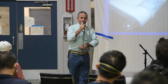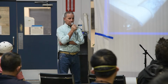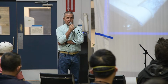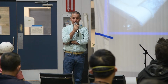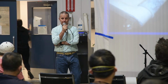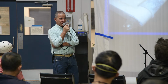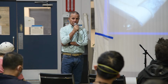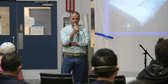Areas that move against each other, and last time I was here I saw some examples of this, where you have masts and other structures that pivot or tilt for shipping purposes. That's really hard to deal with because we have wear in those cases, and the paint is going to be damaged at those pivot locations. So to the extent it's possible, isolating those from each other with non-metallic bushings is probably the best that can be hoped for.